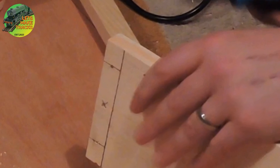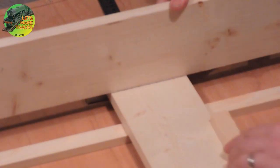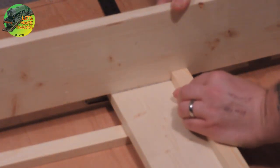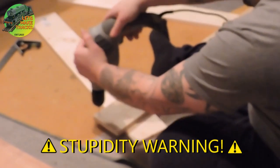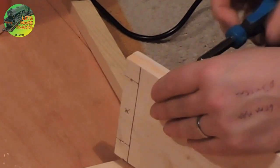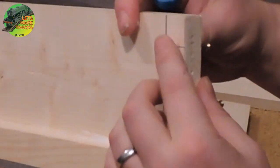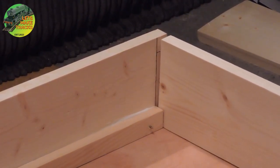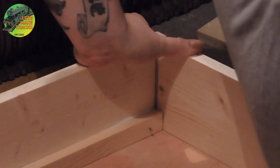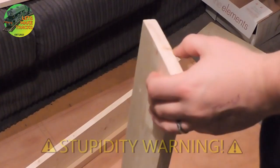The first thing I do is mark out where the screw holes are going to go on all the boards. I line up boards and battens and frames where possible and mark out exactly where their neighbour is going to sit. Once all the holes are marked out, I'll drill through with a drill bit that is 0.5mm smaller than the screws I'm planning on using. To connect the frames at the 90-degree angle, I put screws through the holes just drilled with only the tip exposed by a few millimetres, so I can line up the board with its neighbour and push the protruding screw into the next board to mark exactly where I need to drill.